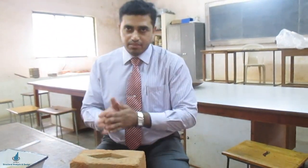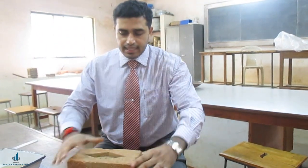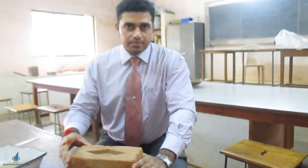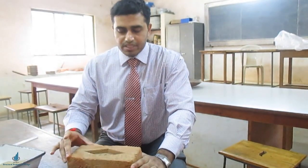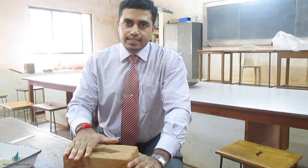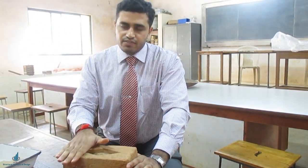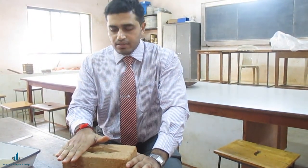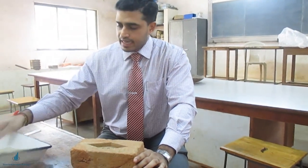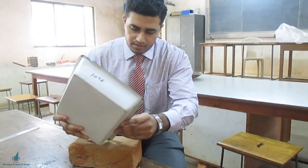Before going to the test, there is a frog on the brick. The dimensions are standard — you can check them in the description box. We have to fill this frog first, either with cement mortar or with sand, so that the plate completely touches the surface. In this demonstration, I will be filling the frog with sand passing through 300 microns. We have to carefully fill this frog completely.